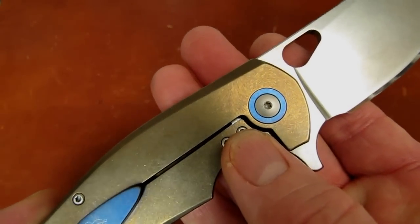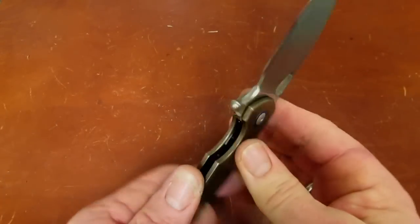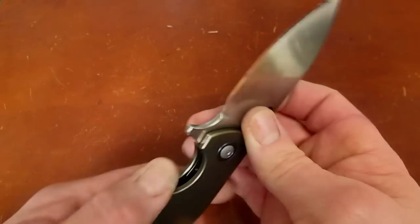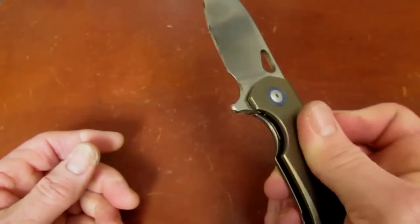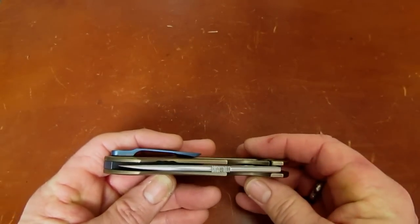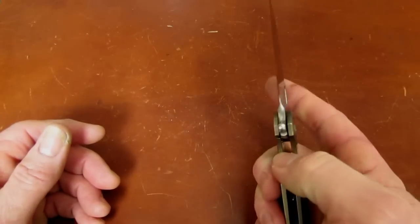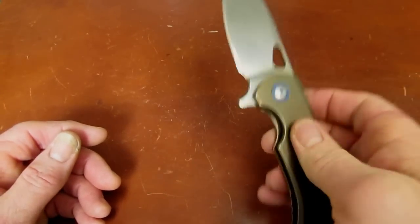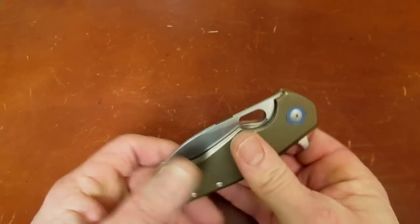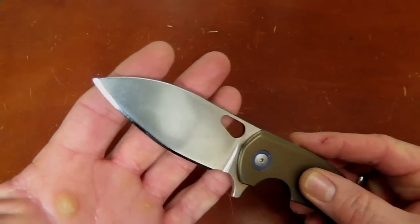Lock-up is achieved with a hardened steel lock bar insert, which also serves as an over-travel stop via a tab in the slot. Mechanically it's a ball-bearing pivot — the bearings are captured in a steel ring, and the races behind them are hardened steel with a radiused groove cut in them. They're very thick, apparently very hard, and give a glass-like smoothness — very well done, as we're used to seeing from Maniago-produced knives.